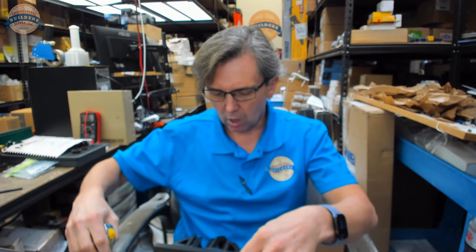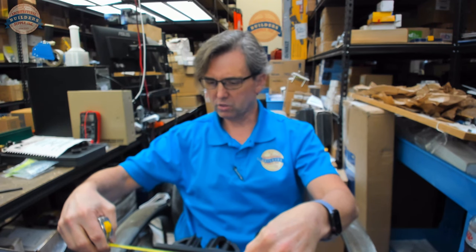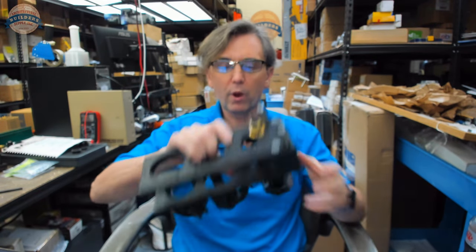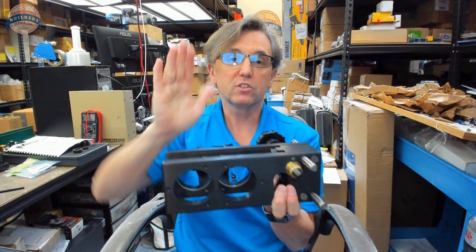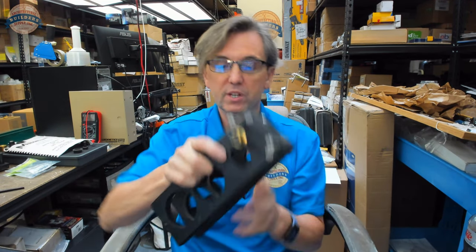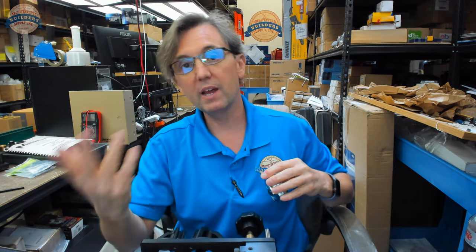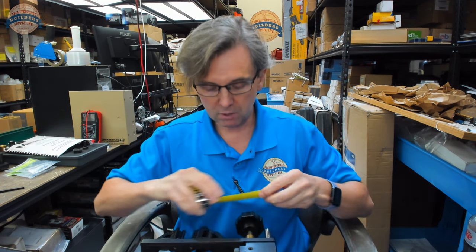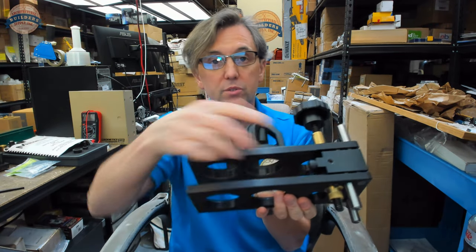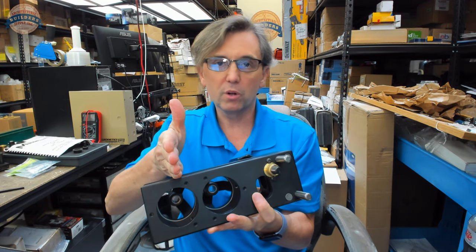So with the bolts installed, most definitely, you're going to drill 2 3/8 or 5 inch, depending on where you're placed. 2 3/8 or 5 inch, that's super simple. You want to do 2 3/4, you remove the two bolts, and of course, as you would guess, the height of that head is going to be 3/8 of an inch, because 2 3/8 plus 3/8 is going to be 2 3/4. And indeed, that is 3/8 of an inch thick. So if you remove the two bolts, that means this is going to go further. You'll drill a 2 3/4 here. You would never need to drill 5 3/8.